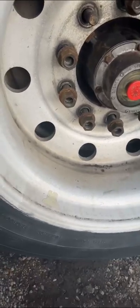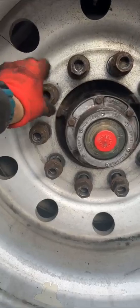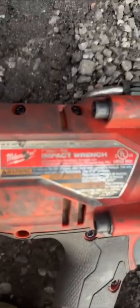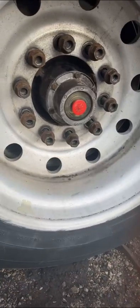You don't need to lift the tire way too high — just enough space to push it out. I like to use anti-seize because salt and rust makes things harder. You start seeing people getting those nuts hot pink or cherry red — I put anti-seize. I already put all of them. I'm gonna tighten it now. This impact tool has been losing power since I got it — it's old. I'm gonna buy another one by end of month and send this one to repair.